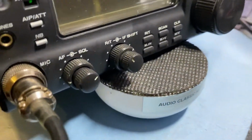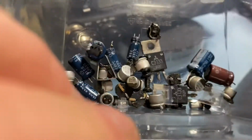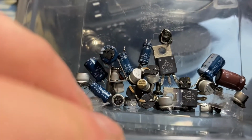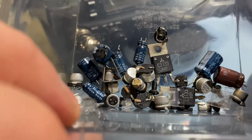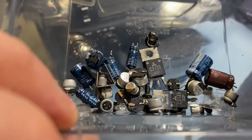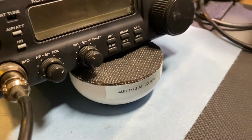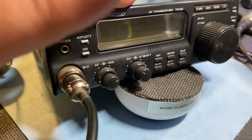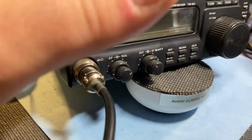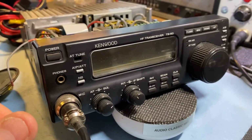That's it. Two transistors there. One didn't function, the other one was weak. Still had current, but just very weak. Bad lollies. So ready for the customer. So there's a final test. I still got to do the actual cap in the display area. Haven't done that. It's only one cap. Use the tantalum, replace it with a tantalum. So basically, that's it.